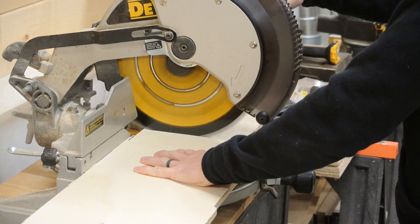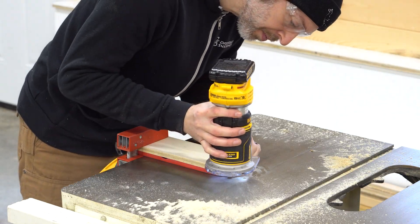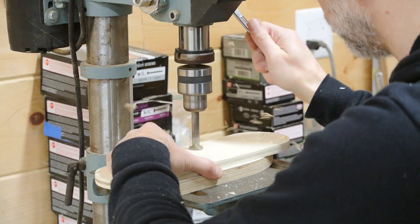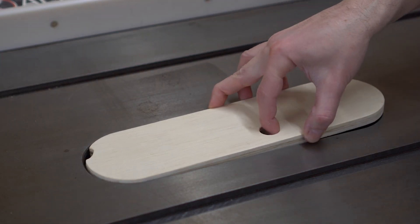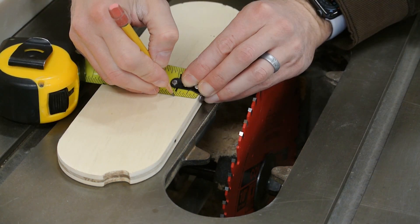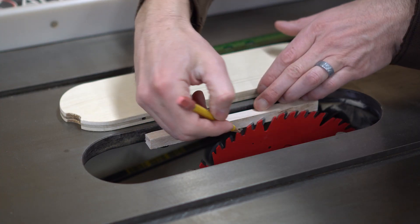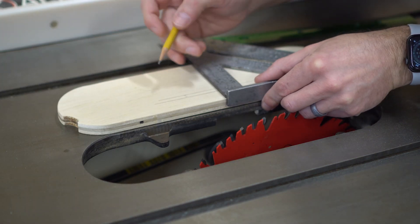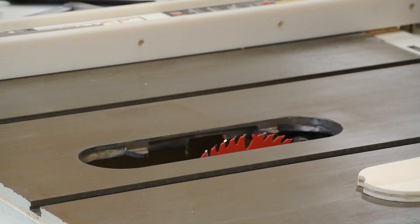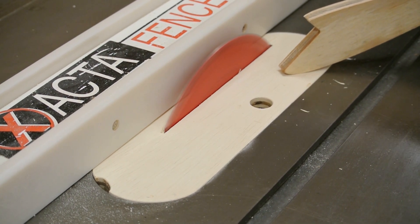I quickly cut the board into a more manageable length at the miter saw, and then head to the band saw to remove the bulk of the waste. I make sure to stay clear of the lines, because I'm going to use a router and a flush trim bit to perfectly match the size of the metal throat plate. I'll drill a quick hole at the drill press so I have some way of removing the insert when I need to, and then I'll test the fit. You can see that the blade prevents the insert from fully seating, so we have to make a recess on the underside. I'll take a series of measurements to locate the position of the recess. To get the distance from the side of the opening I use my tape measure, but I turn to a scrap piece of wood to determine where the leading and trailing edges of the blade are located. When I transfer the marks to the board, I add a small offset to ensure our recess is slightly oversized. Now, with a straight edge clamped to the workpiece, I use my router to cut a groove. The insert fits perfectly, so we can turn on the saw and slowly raise the blade until it cuts through the desired amount. I'm using the table saw fence and a push stick to hold down the insert while I raise the blade.